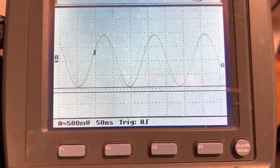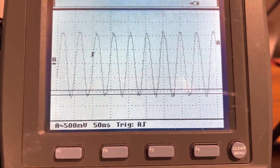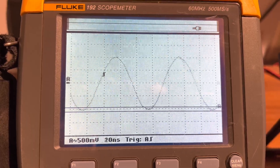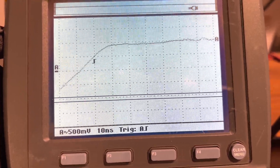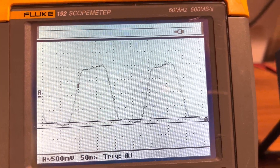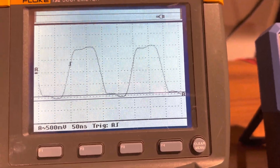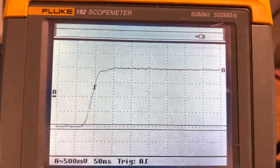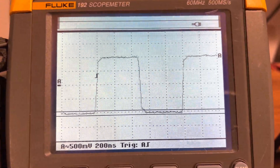Let's just go up to 25 MHz — and there you go, reads it beautifully. Of course if you do square wave it's going to limit it. Actually, let's just go back down — it really doesn't look like a square wave, that's because of this cable causing ringing and stuff. If I go down to 1 MHz that'll probably look a lot better — and there you go, that looks more like a square wave.